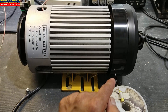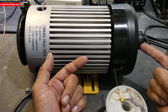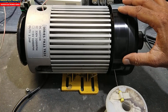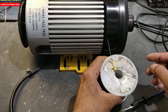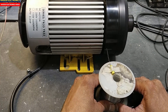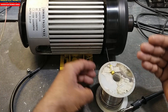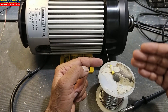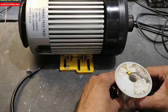I am demonstrating that this motor has an out-of-center shaft. If you see this wheel, it is not centered. I connected a piece of wire — or anything — just bring it closer to the wheel, and we can see that in some places it is touching and in some areas it is not touching. It is out of center. If we check this corner of this wheel, you can see the problem.